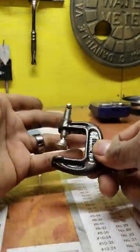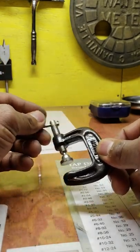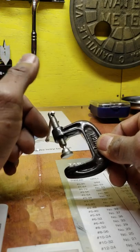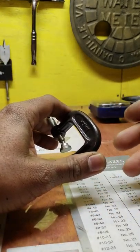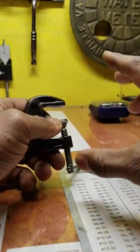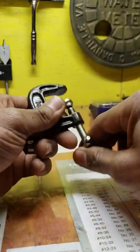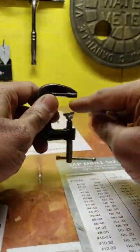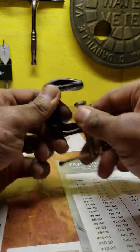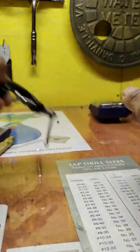Little clamps like these — I picked these up at Harbor Freight — are not a substitute for clamping something down inside your vise, but they're really good for specific situations. A perfect example: a couple of weeks ago I had little shims that needed to be drilled and reamed on a fixture plate, and the big clamps were too big to fit between the drill chuck and the mill table. These little clamps fit perfectly, held the shim stock in place, and worked out great.